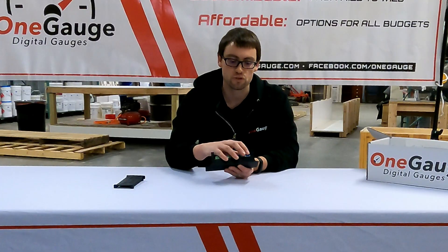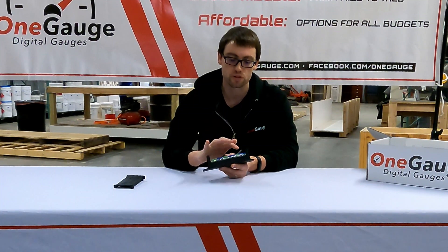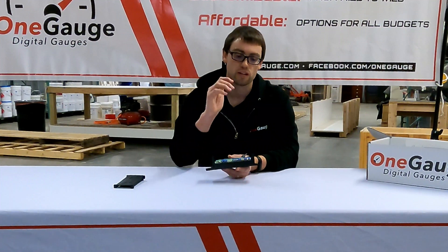Flipping the unit around, the first five terminals are used for your indicator inputs — so that's 12 volt inputs. Just a note: you cannot plug 12 volts into just any screw terminal on here, as you will fry the computer. There are a number of terminals that are 12 volt protected to make sure it doesn't overpower the computer, and the indicator inputs are included in that.